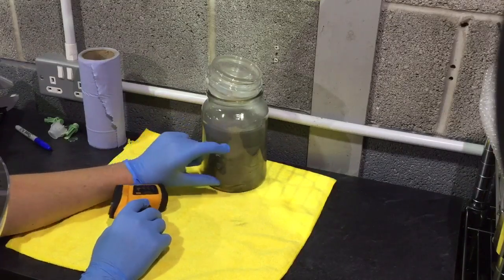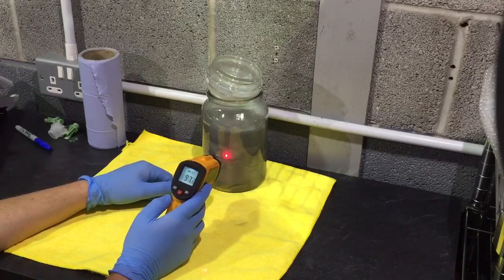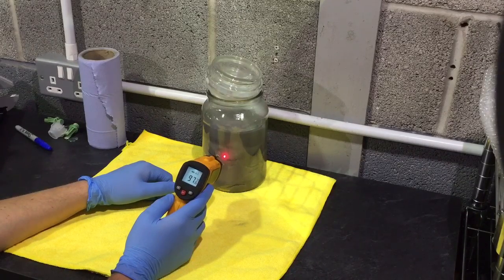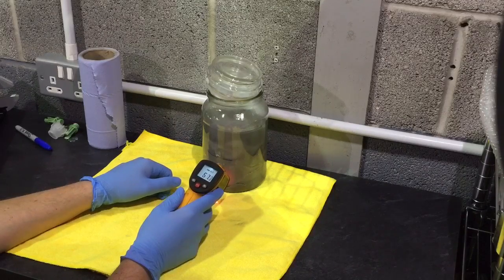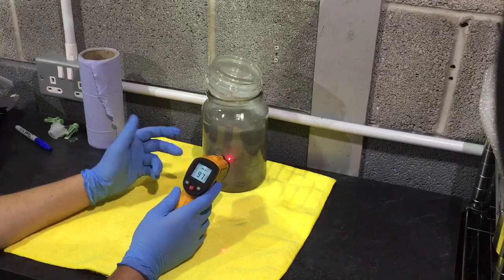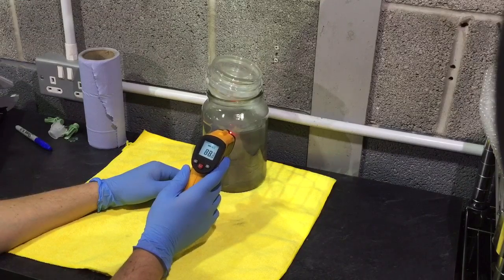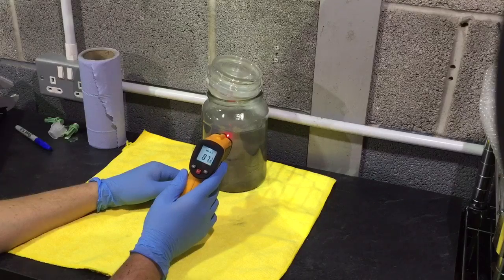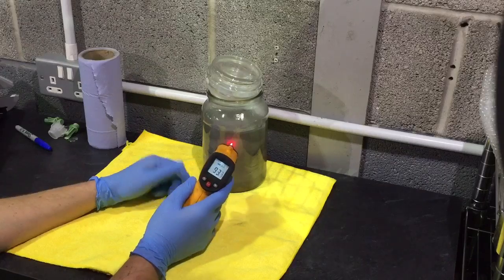There's a different colour matter in the central band — dark grey up here, and then a mid grey here — and this seems to be the hottest section. This is up at 97 degrees C and climbing. Bear in mind, this is the outer; if we were able to pinpoint the inside, I'd imagine that to be well over 100 by now. It cools off at the top where it's levelling out nicely — that's still nearly nudging 90 degrees. We're seeing 98, maybe 100. And that's what you call an exothermic reaction. The actual top of the foam is reading 113, and over on this side, 130 degrees.